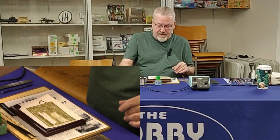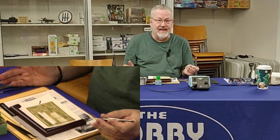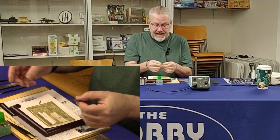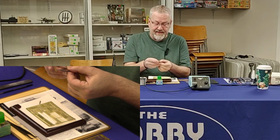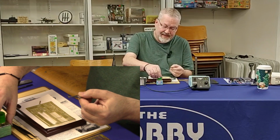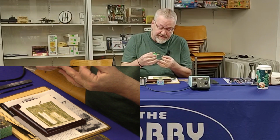The more familiar you become with these steps, you can manipulate the flux like any kind of putty. You can really use it as a separate tool. So what I've got here, I mentioned earlier tinning. The concept of tinning is to cover the metal with a very, very thin amount of solder, the same way a tin can is a plated can. For that, I like using old paint jars because they have a brush in them that you can use for the flux.